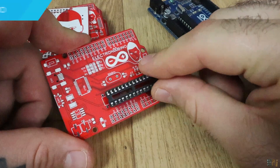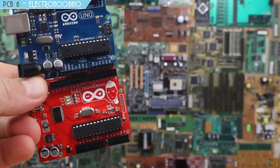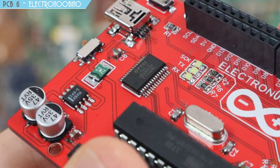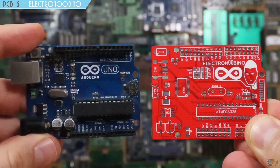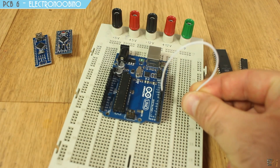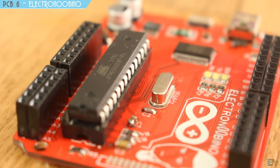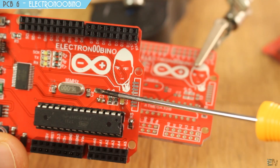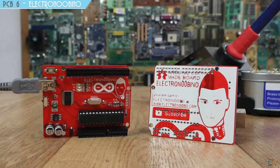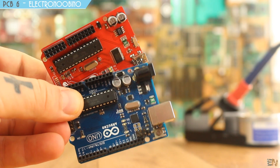Now let's see number 6 — this is my own version of an Arduino UNO board. A lot of you asked about this project. Since Arduino is open source, anyone can make their own board using the same schematic or adding new parts. My version has a red solder mask with white silkscreen, a double row of pins for breadboard use, a mini-B USB connector, an FTDI programmer, a DIP Atmega328 chip, white LEDs, and an SPI SMD port for the NRF24 radio module. I've also placed my logo on the back, and it remains compatible with any Arduino shield.